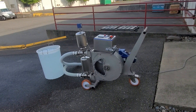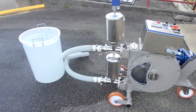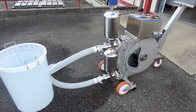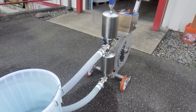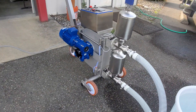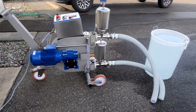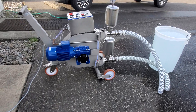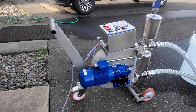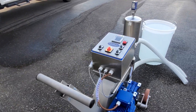This is a Zambelli Zeta PE45 peristaltic pump. For those unfamiliar with peristaltic pumps, they are just about the best pump you can get. They've got a footprint similar to that of a large flexible impeller pump, much smaller than a mono or screw pump, but they're more gentle than just about anything out there. So they're great for transferring both fluids and musts, but also whole clusters of grapes and whole fruits.